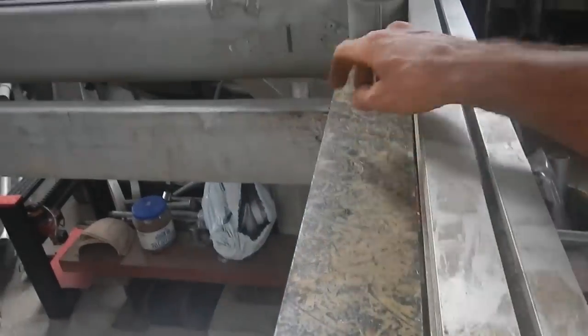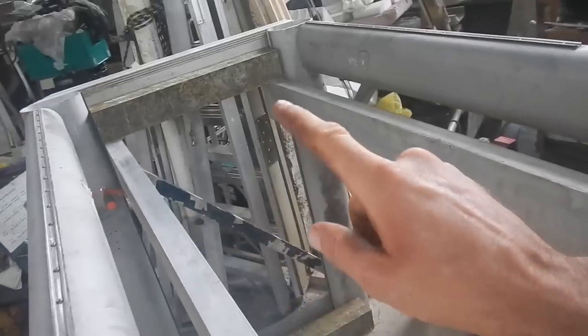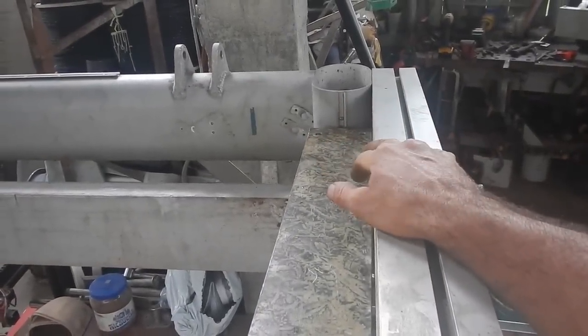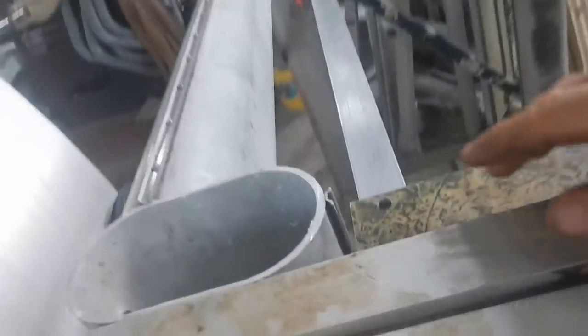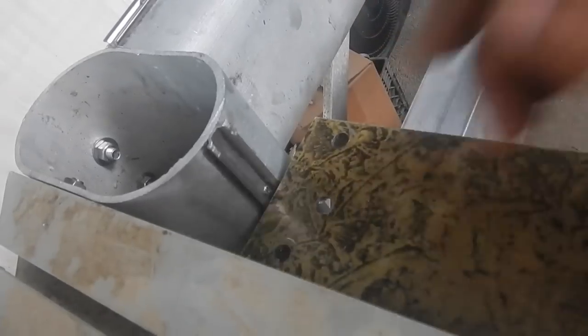Can actually attach rollers now. And I lifted this up to be near the top because the rollers need to fit up here like perfectly. If they're a little bit off down at the bottom, it's fine because, you know, it can flex a millimeter or two down here. But up here, it's held rigidly in place. So it needs to fit as perfectly as possible up at the top.